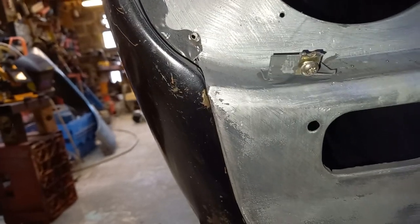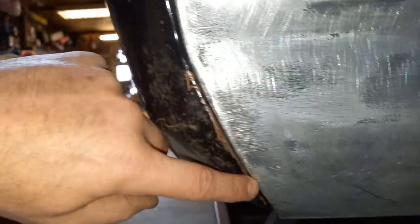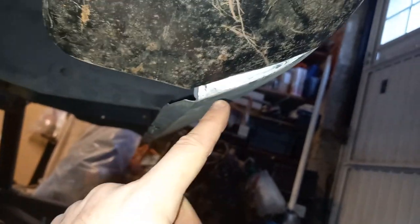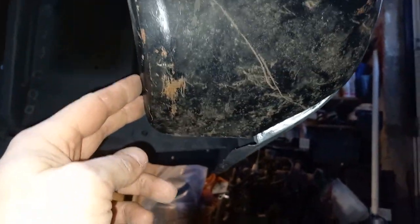Okay, just a little bit of hammer and dolly just to get those flanges flat. Already I can see a massive improvement on that line. So the next bit is getting this to look right here. So what I think I'll do, rather than trying to bring the front of the wing down to meet that, I was going to bring that up to meet the wing, but saying that, that's going to mess up that line along there. So this wing's going to have to come down. Having said that,